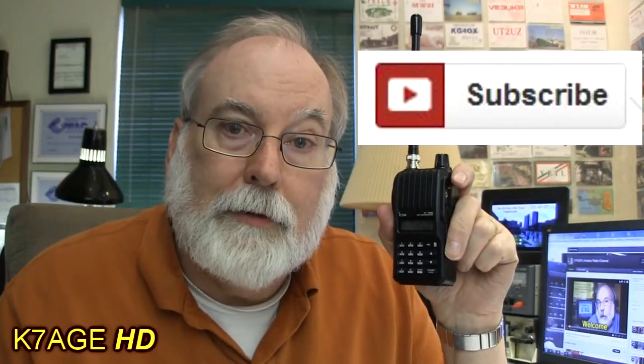This series of videos has shown you basically how to get your 2 meter FM radio going — how to set it up, check the basic functions, do volume and squelch, enter a frequency, and enter the parameters needed for repeaters. There are other features too: scanning, naming channels, weather alerts, and other bells and whistles. But what I've shown you is enough to get on the air. If you have a mobile radio, it's programmed the same way — just a different shape, bigger display, maybe more buttons, but the basics are the same: repeater frequency, offset, and tone. Learn how to store it into a memory position so you can recall it easily, and you're good to go. I hope this has helped. Please press the thumbs up button, and subscribe to my channel. Thank you. Randy, K7AGE — have fun on 2 meter FM.